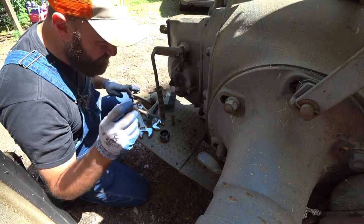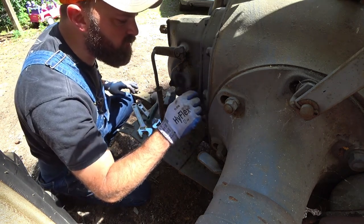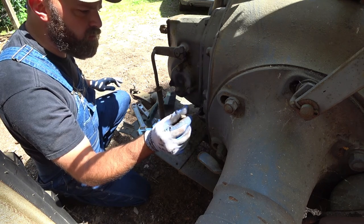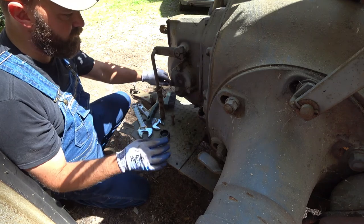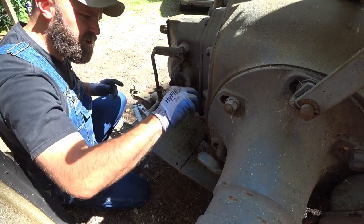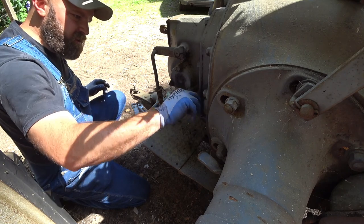Take us a stick. See if there's any oil in it. There is visible oil. It's a little low. I think the book called for an oil viscosity of like 150. But it's got enough oil in it to do what we're going to do. It is not dry, so it'll still sling enough to do a test run today.